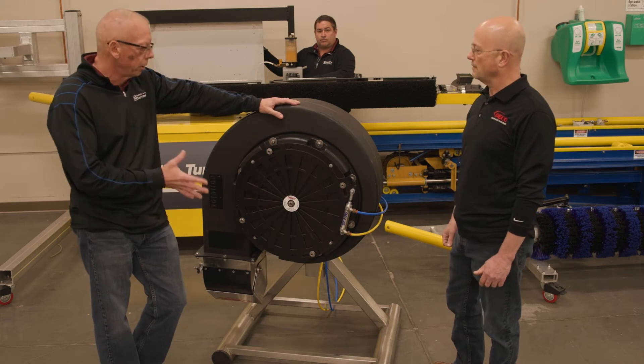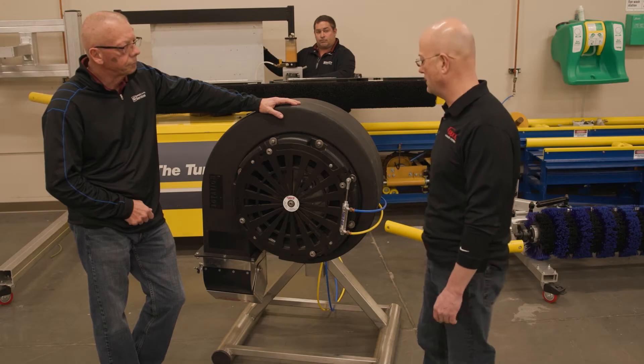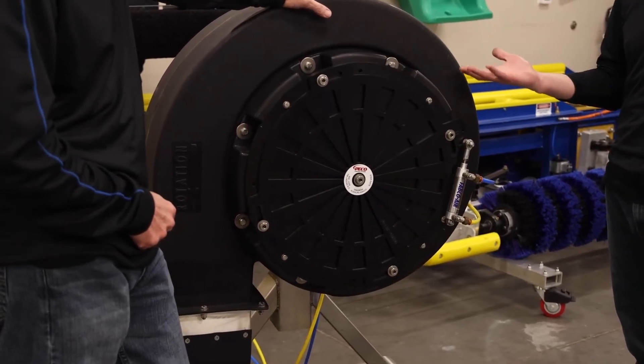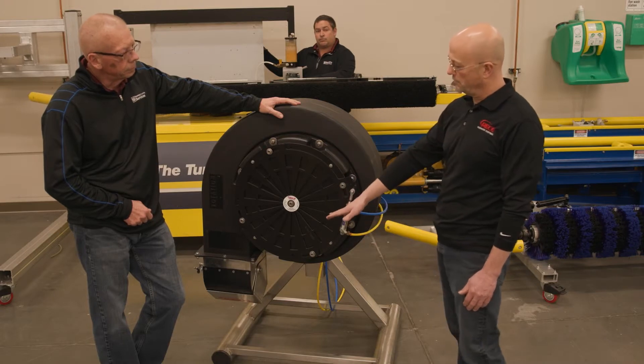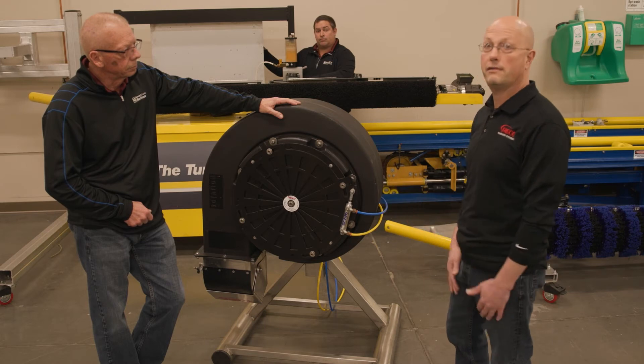This unit has what you call a stargate — we call ours a gator. The function is kind of the same; it's an air gate. It serves the same purpose: we'll close it and it will reduce the amp load on the motor, as well as not allow any air to come out of the nozzle, which is great for open pickup beds and things like that where you don't want to have the air blowing on it.